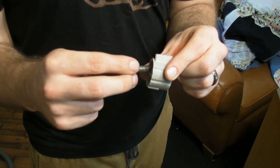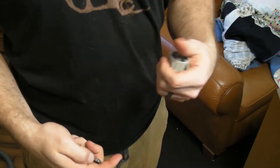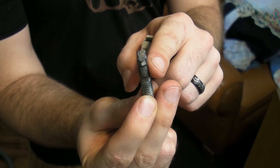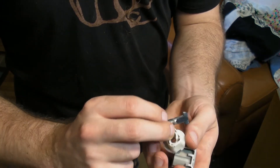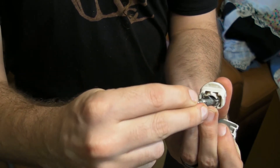The crank drill shaft driver on the left side of the gun kept slipping — that's why we were having all those failed firing tests. What I ended up doing was going with a larger bolt, grinding it down into kind of a T-shape, heating it up pretty hot, and actually melting the shape into the plastic so it's going to give it a lot more purchase.